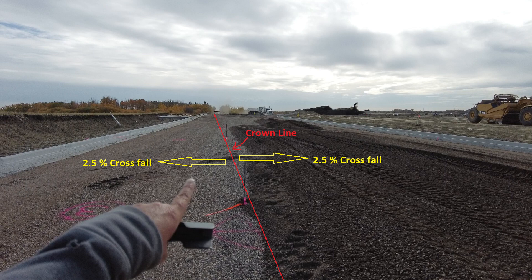This job is a bit unusual. Normally the crown would be consistently right down the center. On this job, the crown is not only off to one side, but it varies all the way. At the end of this photo, the street is 60 meters wide, but it gradually tapers down to 46 meters wide.